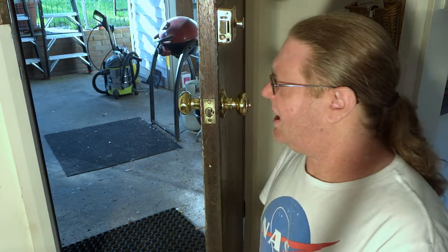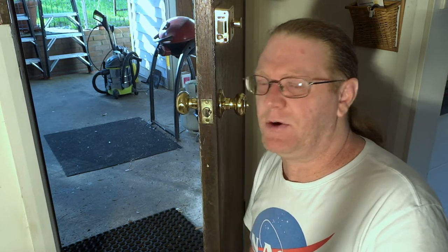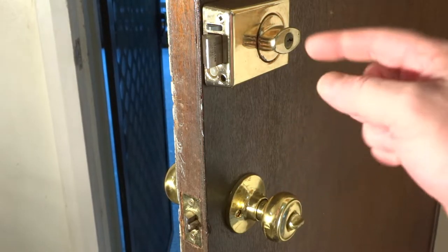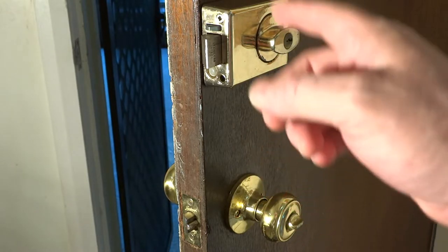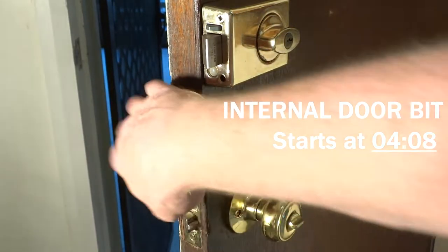G'day internet, CJ with you again. So the most popular video on my channel by several hundred thousand views is a video about lock picking, but it's actually not about lock picking — it's about latch slipping. There's been fair feedback that it's a rambly, bad quality, potato quality video that could be done a lot better, and fair enough. So we're going to deal with two different doors in this video: an external door, both with a surface mount style security dead latch — we're not going to address that, I'm going to disable that shortly. Door one: external with dead latch. Door two: internal without dead latch. Both have a thumb turn; the external door has a keyway.